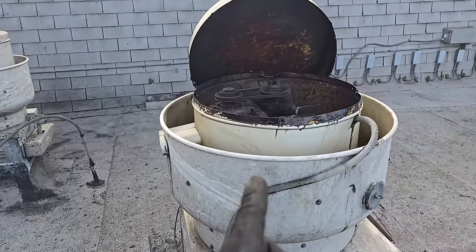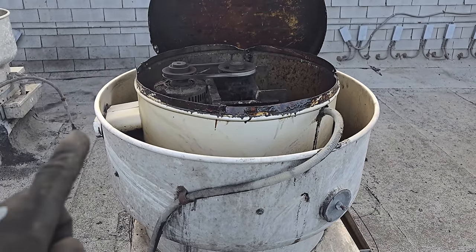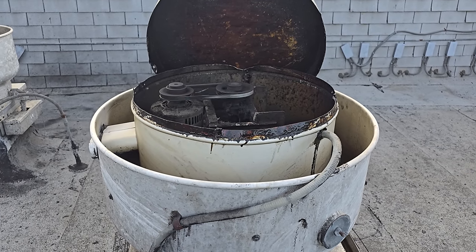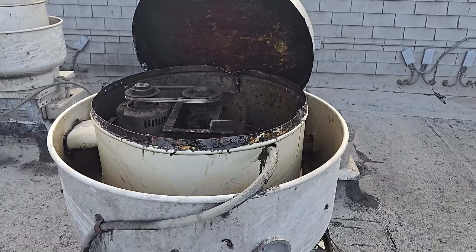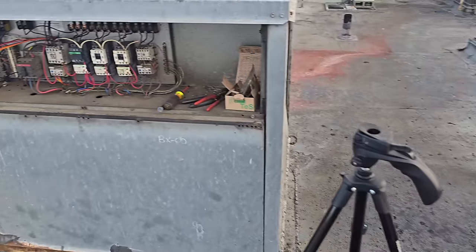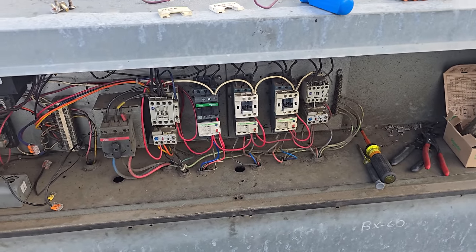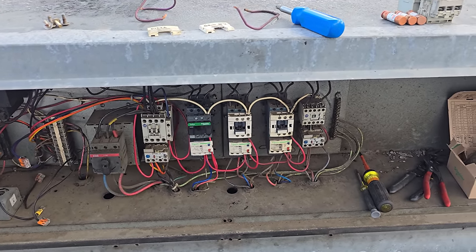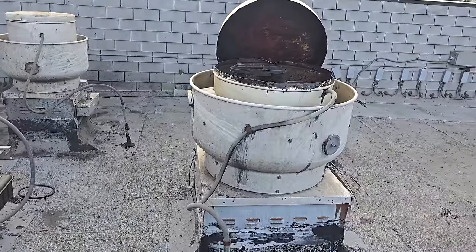This right here is in really bad shape. The whole fan is shaking off the roof. The motor looks like crap. We need to talk to him about replacing this fan. But it's running, it's in the right direction. When my technician was out here on Saturday, there was electrical shorts in here. Like, he found a bunch of problems. And then I came out, helped him bypass, install the temporary starter, and that's what got us going. So we are back up and running again. 24 volt starter installed. Everything's hunky-dory, and I need to get some specs off this fan for replacement now.